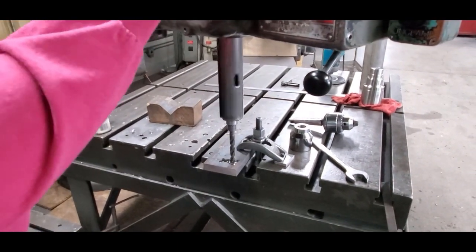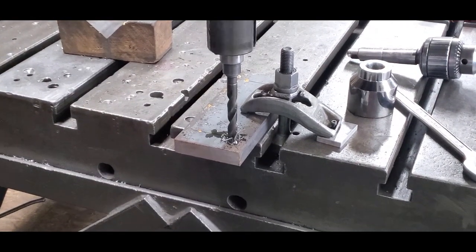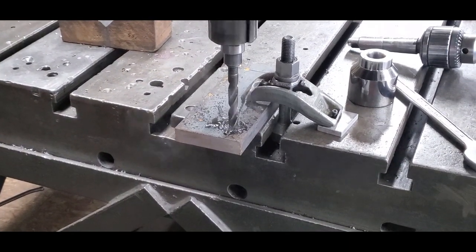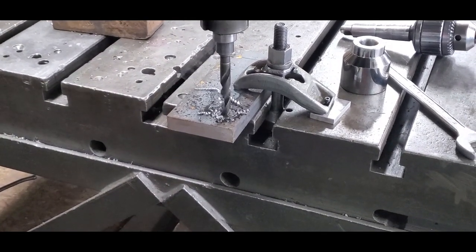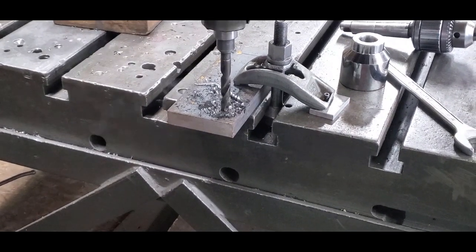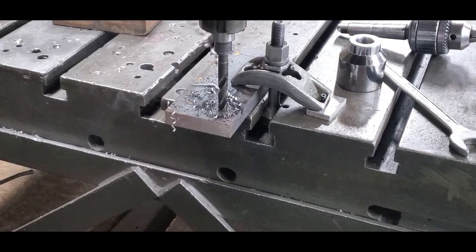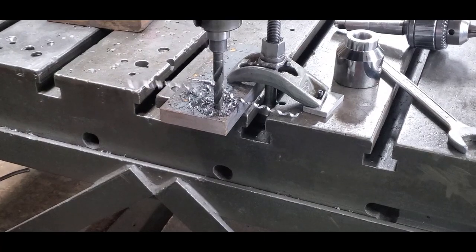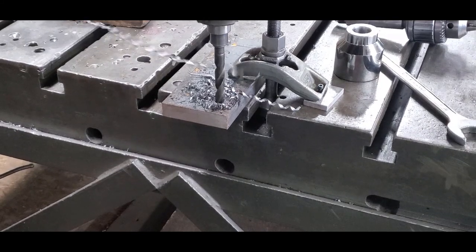Might notice a socket on the table there. I had drilled out the 3/4-inch square drive with a hole saw, and we put that into a lathe and opened up the hole to a clearance hole about an inch and a half. And that socket's going to be used on the Skinner steam engine. Going to have to cut a slot in it and then bolt a breaker bar of sorts onto the back or weld it, so I could use it to loosen the jam nut on the crosshead slide. It's a 2 3/8 nut that socket is going to fit on, but it has to fit over the piston.